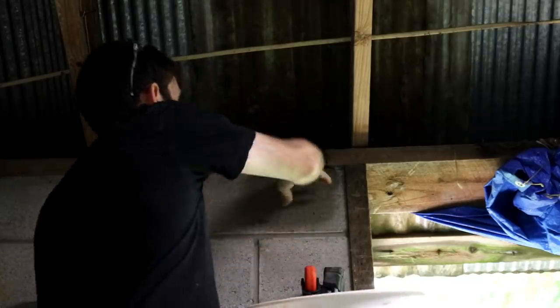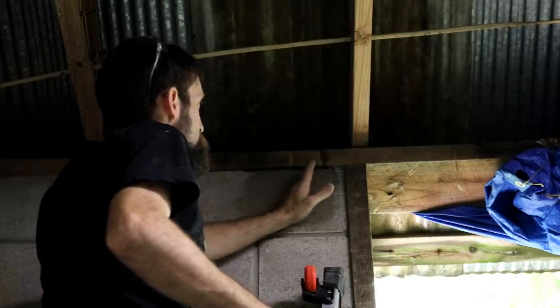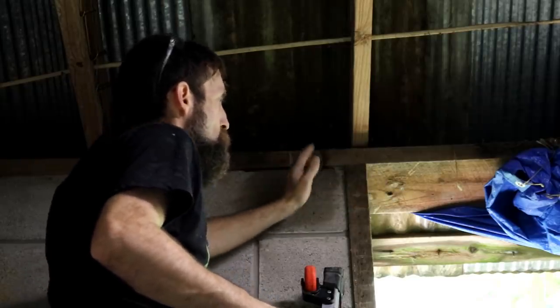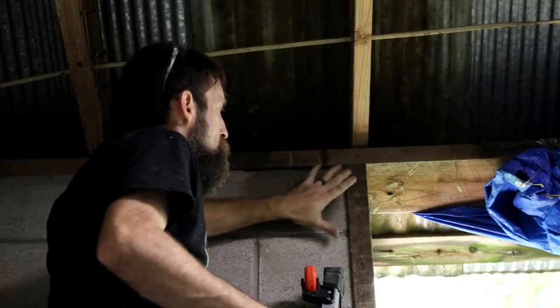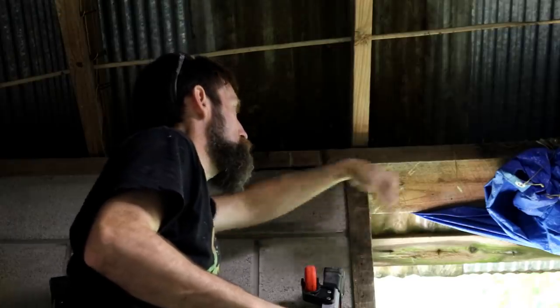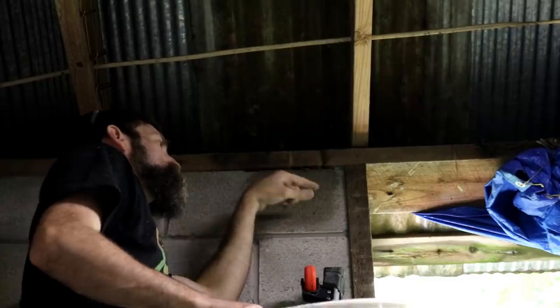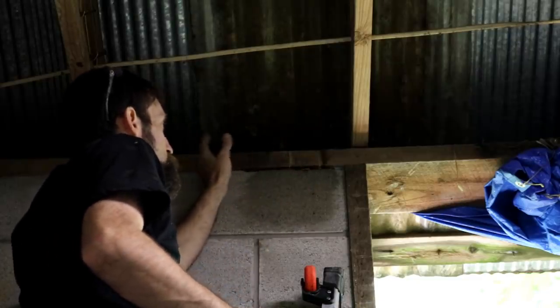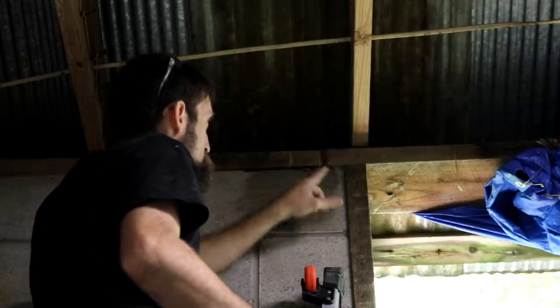Wiping off that extra cement that I got on the blocks here. So, anchored at the transition between the block and the opening to the sill plate on both sides, and anchored at both the top anchors on the oak that they'll be framed to. I still need to anchor to several spots along the block to the sill plate on both sides.